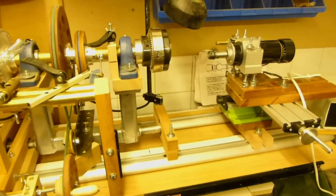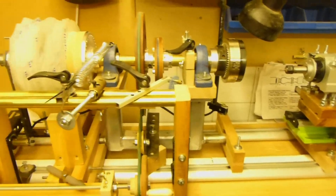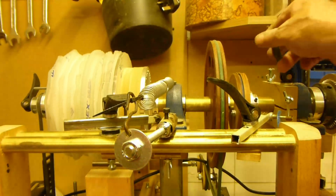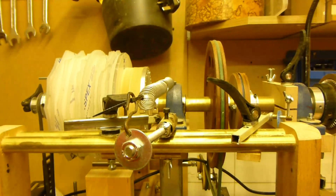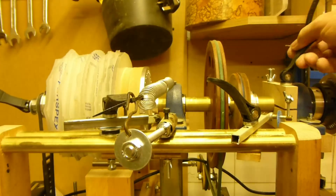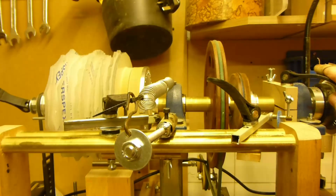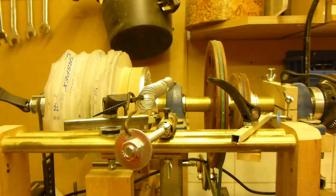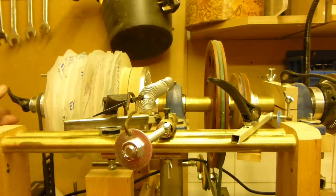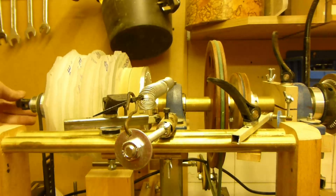The cutter motor is on the white and comes out of a micro-link machine. This is the main clutch mechanism, operated by releasing the lever from the left — which is at the rosette end — and applying the lever, which is a brake, to the main shaft. That's the lever on the right-hand end of the picture.